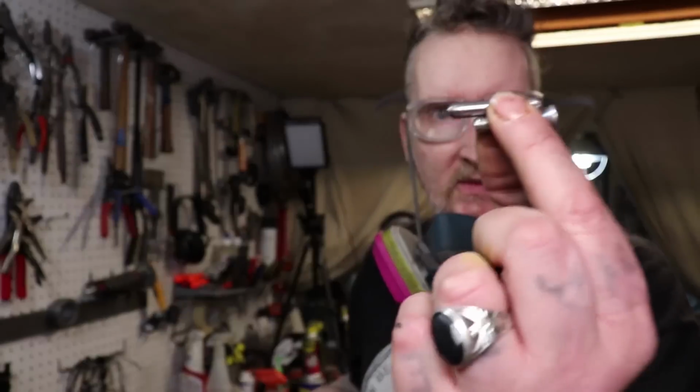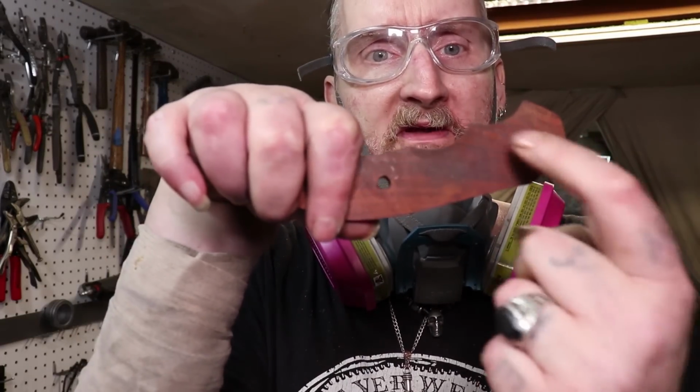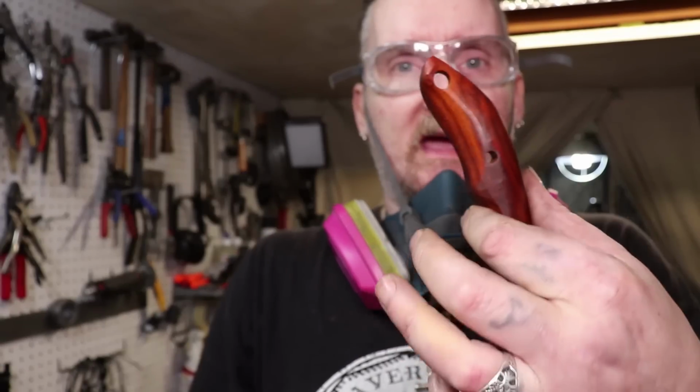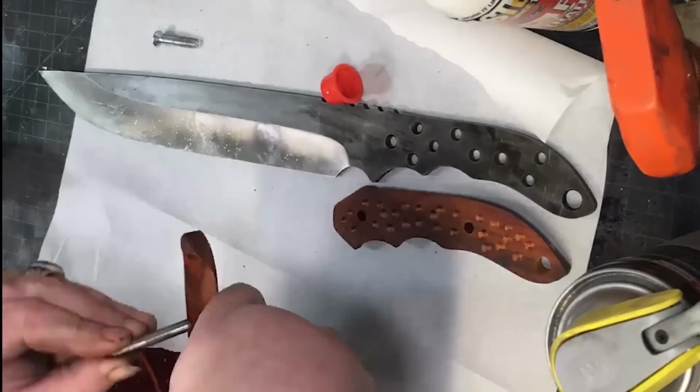And this is the shorter one. So the first thing I want to do is just take the 1/4 inch and drill a bunch of little teeny holes in here on both sides. Not deep, because this is basically the shape. But I just wanted so the epoxy will go in this. I've got holes in this. That way it'll all lock in. All right, I'll be back.